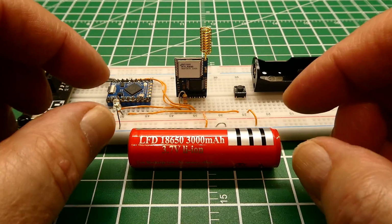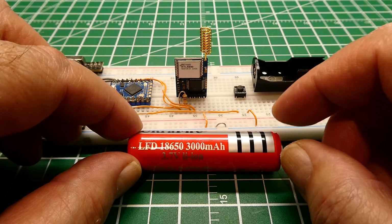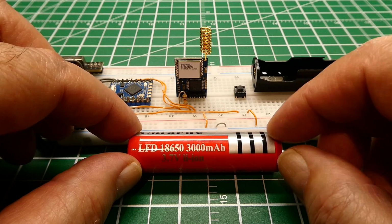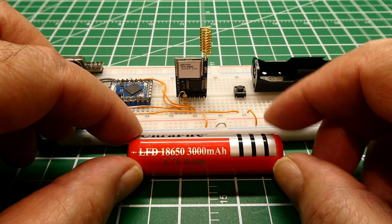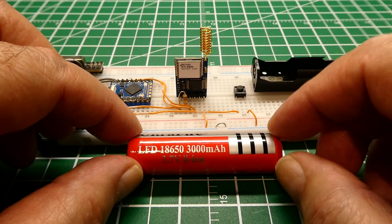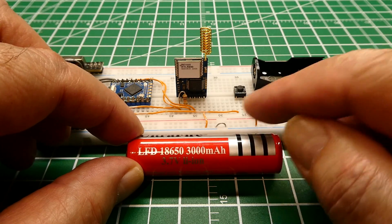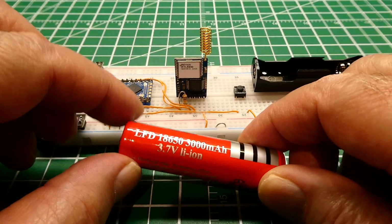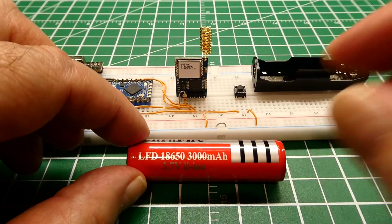Okay, I have built many battery-powered projects using the 18650 lithium ion cell, which you can see here. Now I've since stopped doing that. I find that this battery is physically a little bit too big for the enclosures that I want to use for a sensor out in the field. Also, you have to buy a buck converter, and they're usually pretty noisy, the 3.3 volts that's feeding your project. And I've actually seen one of these explode, and it's pretty violent. So if I want to build a project for a friend, I want something a little bit more safe.